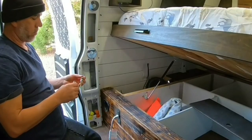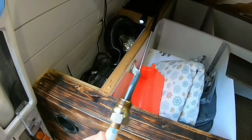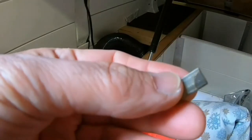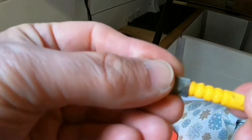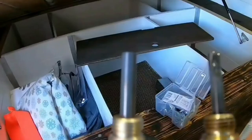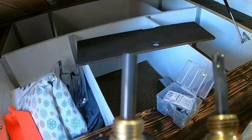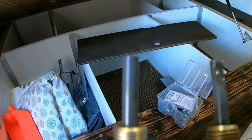So far it's been pretty easy — I haven't run into anything that's difficult. Here's the part; it really doesn't seem like there's anything wrong with it, but what do I know? It's got a screen filter in there. I thought I was gonna have a hard time getting it out but I just pushed it in there and popped it right out. If you look at these two side by side, the one on the right is the one that's damaged — the cylinder is not all the way round, there is a small portion of it that's missing.